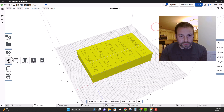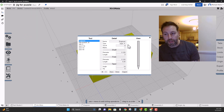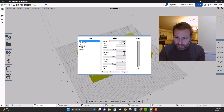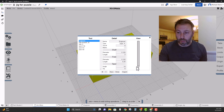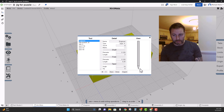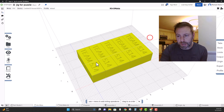Now you're going to add a tool. Go to Machine Tools and add an engraver — it's going to have a taper. It has a 0.125 inch (one-eighth inch) shaft diameter, and the length is about two inches for the gray portion. The flute is 0.125 inch diameter, has a 0.25 inch length, and tapers down to zero. The angle is calculated for you after you enter all this. Then hit Save and close out.